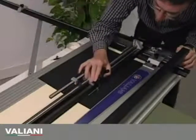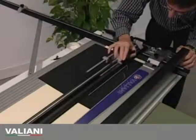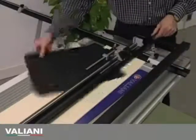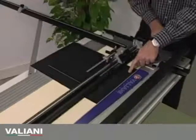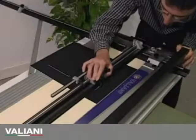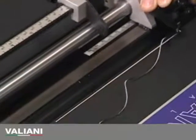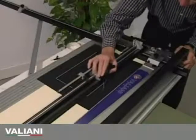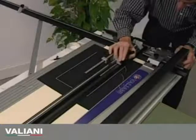Start cutting slightly into the board so that the thin V-shaped line comes loose from the board. This time, you may not push the blade entirely into the board. Be sure the board is placed well against the left-hand stop. This is the clue to a perfect V-groove. Try to work slowly but precisely, and don't forget to use the new blade to get a perfect result.